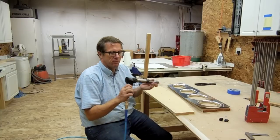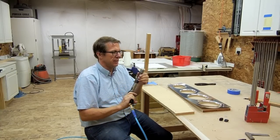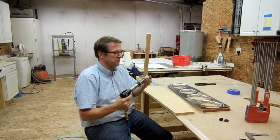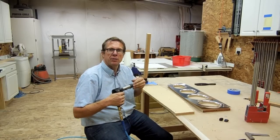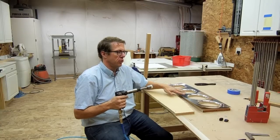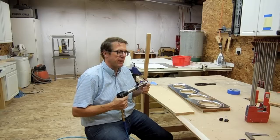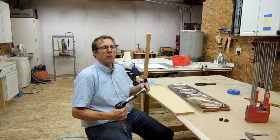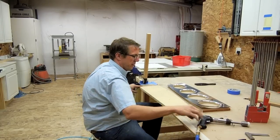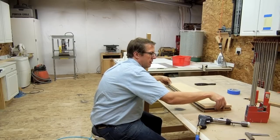What I'm going to use for doing the flanging is a rivet gun. It's a 4X rivet gun here, and I'm using a TM Technologies flow forming head. This thing is pretty neat for actually forming the rib, the aluminum. I have a little tendonitis in my arm, so this has really been helping me on not inflaming that quite as much. It probably doesn't save me any time, but it saves a lot on the arm for the hammering part of it. So the first thing I'm going to do is clamp up the jig.